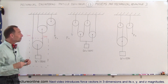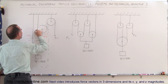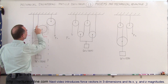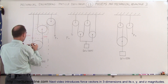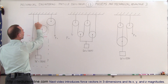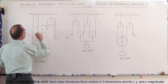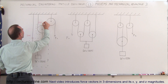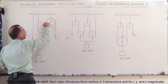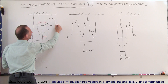If we draw a second free body diagram around this part of the pulley set, notice that the force pulling down here, which is fifty newtons, must equal the sum of the two forces pulling up. Since it's the same rope going around this pulley, the tension on both sides must be the same. They must add up to fifty newtons, which means twenty-five newtons on each rope. Since this rope goes around this pulley, the tension here must equal the tension there — also twenty-five newtons.